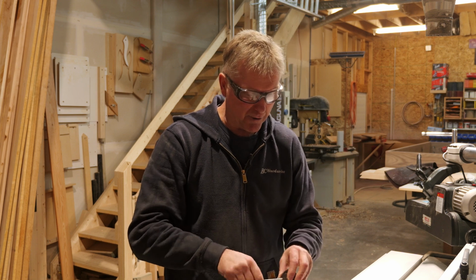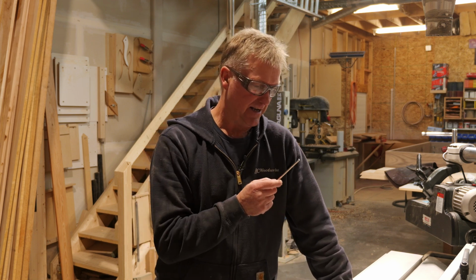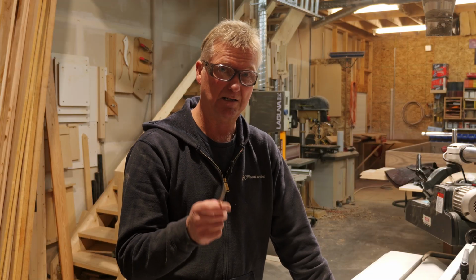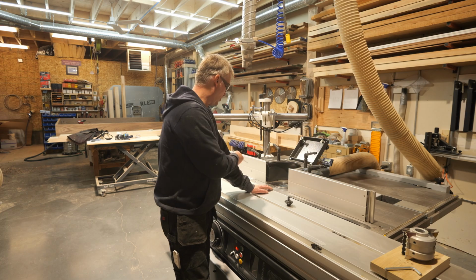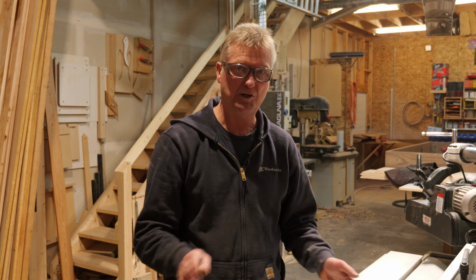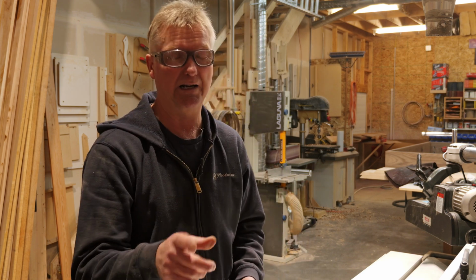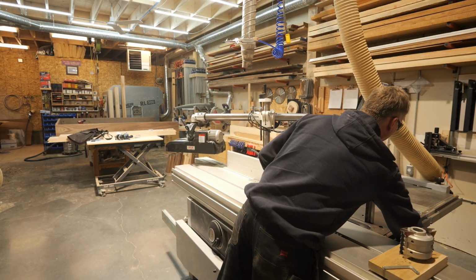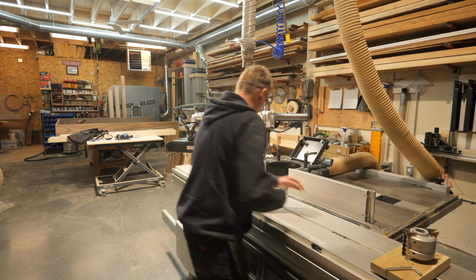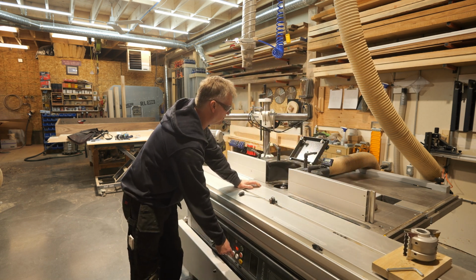So there is, of course, one major thing to all of this, and that is the fact that by doing it this way, you're not having to slide the slider back and open up the cover, which trips the micro switch on that cover and isolates the machine. So as soon as you do that to change cutter heads or knives, the machine is isolated. With this, when we don't open that up, the machine is always live. So you've really got to keep your wits about you and isolate the machine before you change cutter heads. It is really important to isolate that when you're doing this.